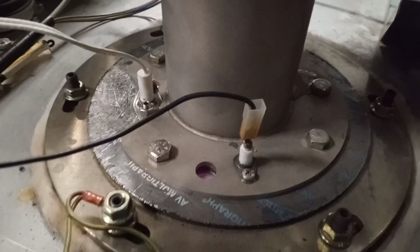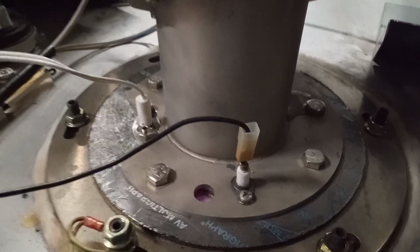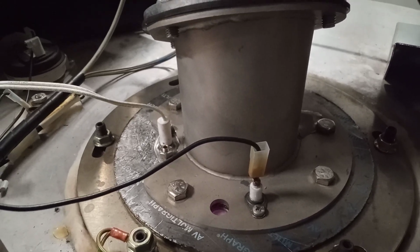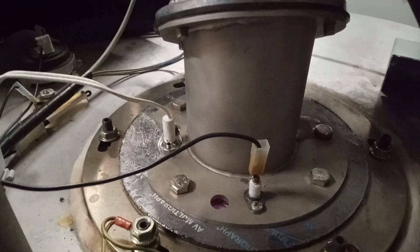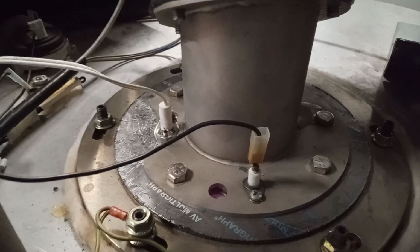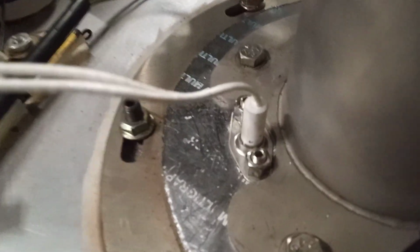So I did my general checks, but it's a good thing I had a look up, because what you should do when units are not firing, always check the easiest thing first. Look for the silliest thing that it could be. So anyways, I went a bit deep and didn't look for the basics. Maybe it's the time of night or something, but here I was about to pull the burner out. Instead I was checking the resistance on the hot surface igniters